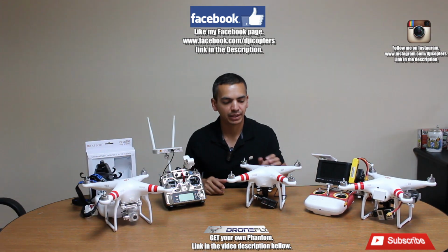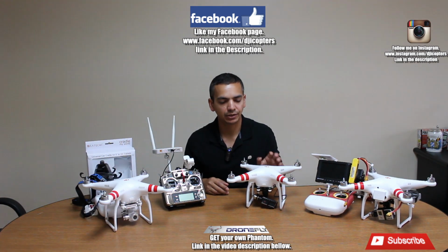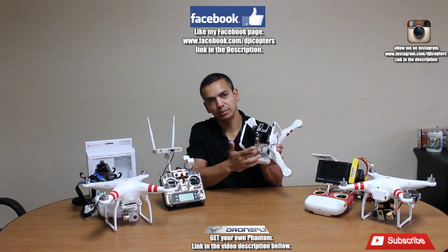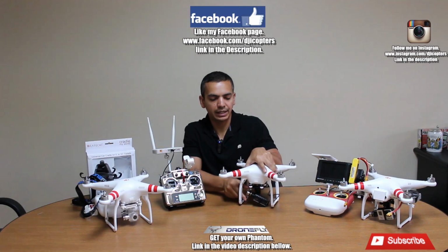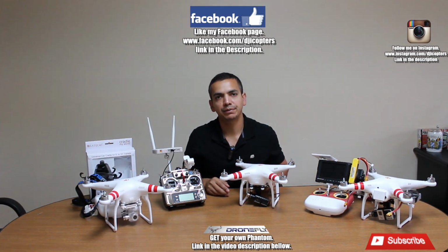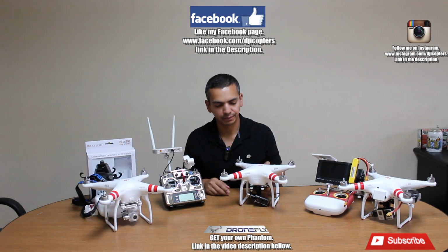On that range test video that I mentioned, I could have gone further, but I had to come back because of the battery life. Why? Because with this system, the video transmitter for the Lightbridge is a little bit heavier than any other video transmitter, and it's been giving me flight times of anywhere between 10 and 14 minutes, reaching 30% of the battery on the Phantom.